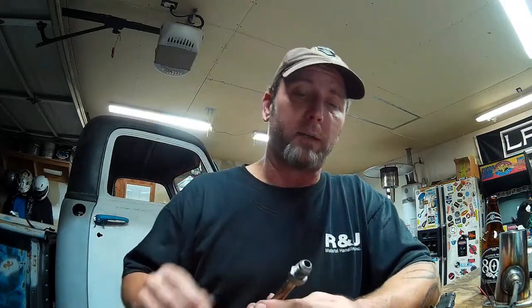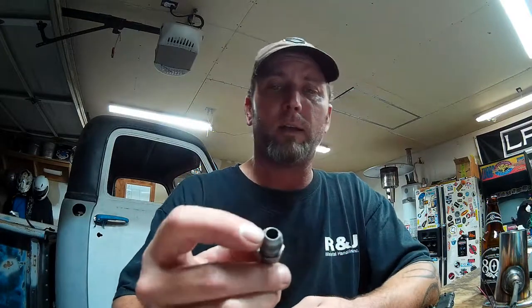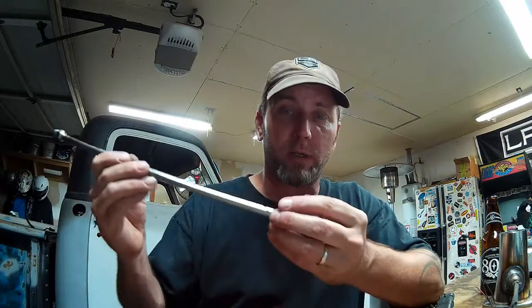I thought everything was fine when I pulled it out and looked at it, but I looked a little closer here, and it put two notches into our sealing surface on our AN fitting. So I pressure tested it anyway. I cleaned it up with a file and hit it with the wire wheel again, this time without the gloves on, so I could have a good grip on it and good feel for it. I stuck my AN fitting on there, pressure tested it again, and it leaks. Fortunately, I left it long so I could trim it to size and fit it into the tank.